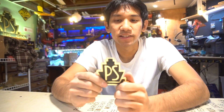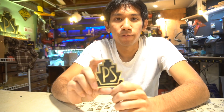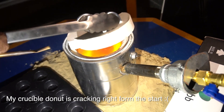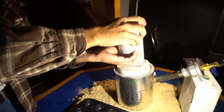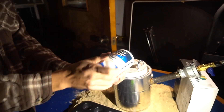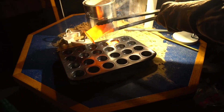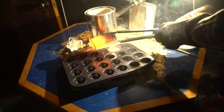There it is — my first brass casting. This didn't quite go so well for the first few attempts. At first we just tried casting some ingots, which was pretty cool. I'm also going to put some borax in there — the borax keeps the zinc from flashing off. Oh, look at that — let's see if anything pours. Whoa, look at that! Oh, that's amazing. Oh, that's so cool — it's liquid!